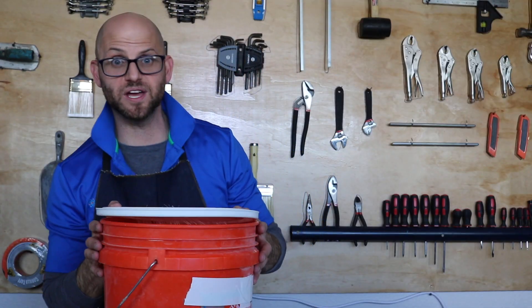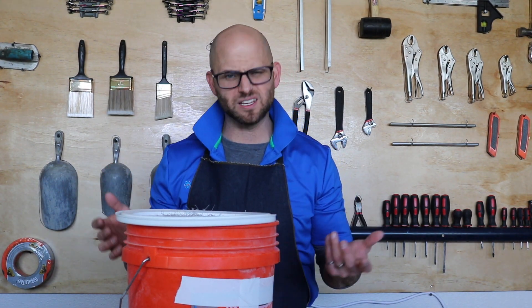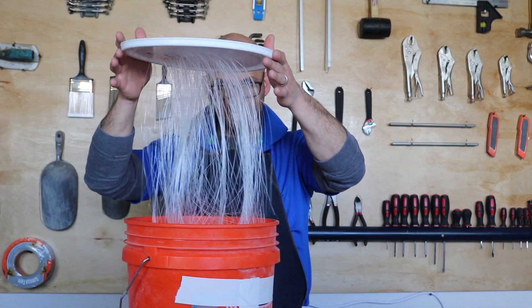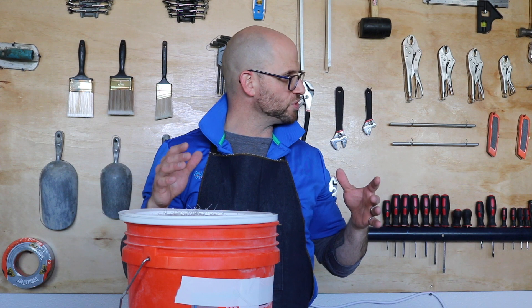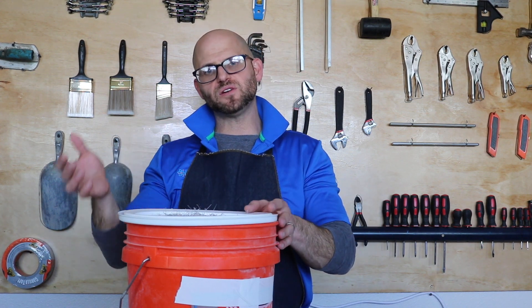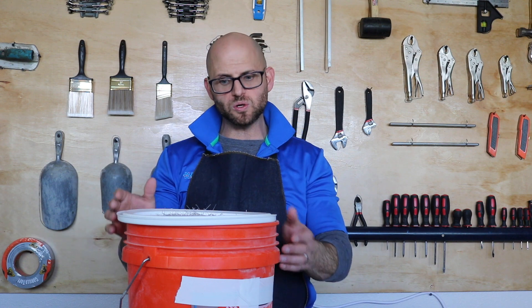What we're doing is making a countertop and we're trying to show folks what we can do with concrete — the fun things that can be done. One of them is using this optical fiber concept where we've got our logo; lights will be passing through in a glow-in-the-dark concrete portion. So after the light source is shut off, the concrete will still glow where our logo is.